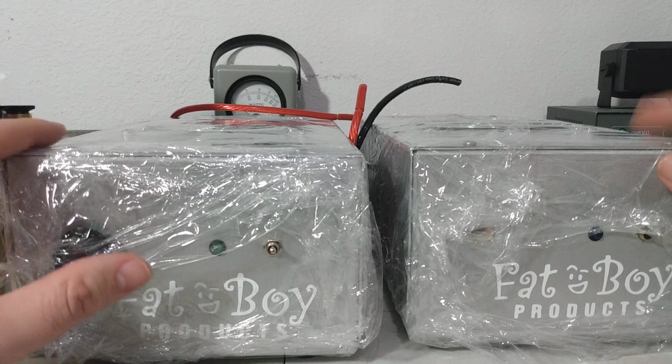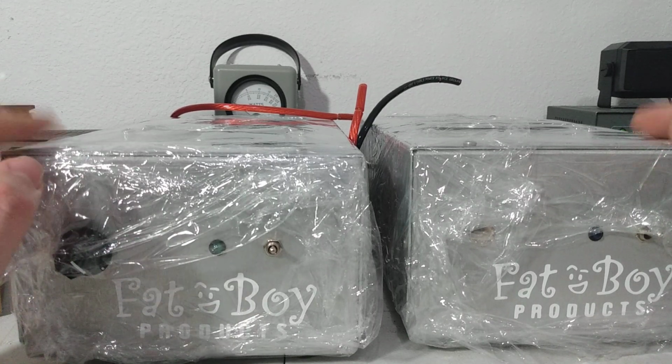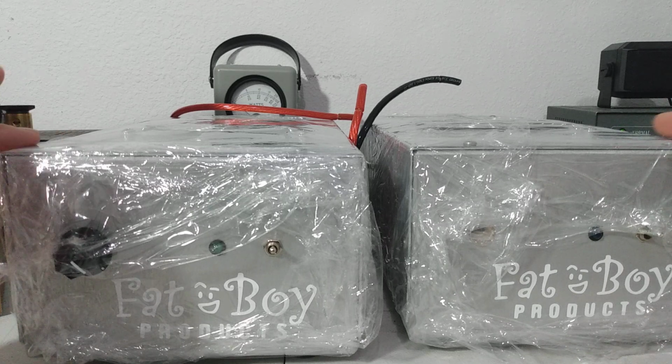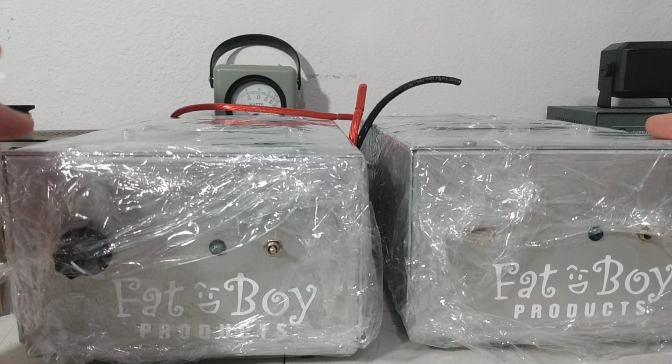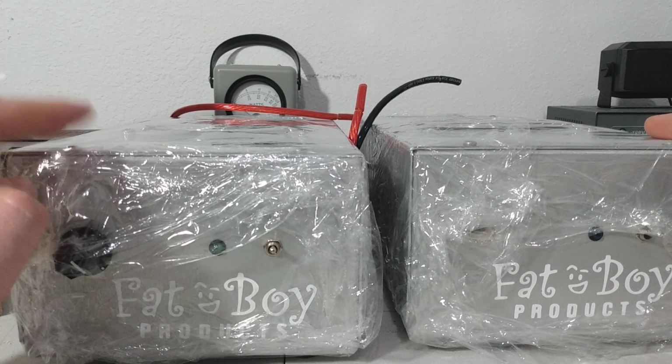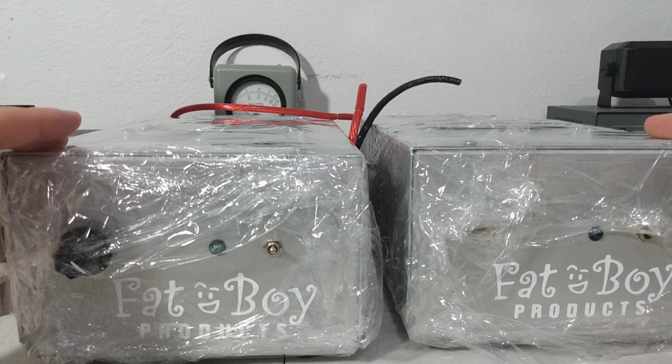In Class C, mainly Class C, you can get these amps biased, but typically Class C. In the Class C competition style amps, low drive amps take about 2 watts dead key, 35 to 40 watts PEP. The 2 in this amp, it's a 2-drive and 4. The 2 tells you that it has 2 driver transistors in it, and the 4 is the 4 output transistors.